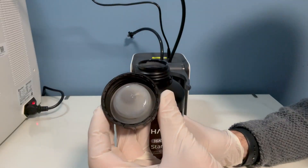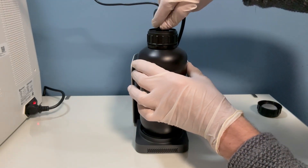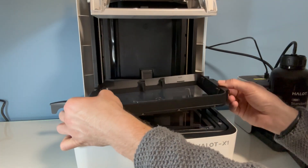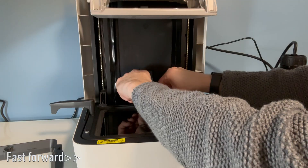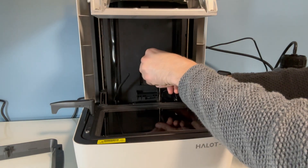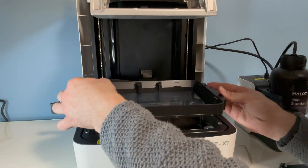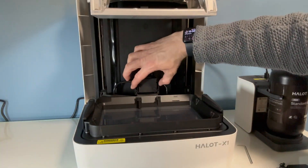The pack includes a feed tube and a replacement lid which then connects to the hose on the auto feed unit. The resin vat has two large handles which makes it very easy to remove. This means you won't be able to accidentally close the lid unless the vat is locked in place. As I'm using the auto feed unit I need to remove this small piece of plastic so I can install the detection unit. The resin hose connects to the left of the detection unit and the power cable to the right.